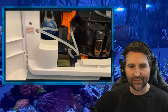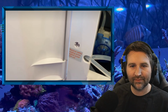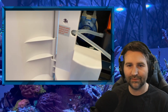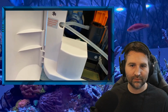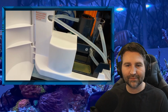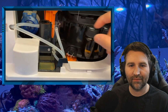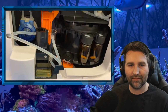Here's the inside. Right here, we use the same stepper as the Alcatronic or Dosetronic, to pull tank water out of the tank. That's the sample water, and then it will go into this reagent chamber. Within the reagent chamber, there are sensors and LEDs to pick up the different colors. Next to it is the RO chamber, where the needle goes inside and does all the rinsing. And this is the carousel, which carries 12 little vials, and it's very easy to take out, just like that. And then I just pop it back in.